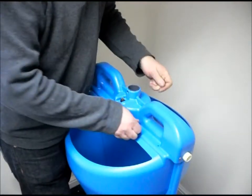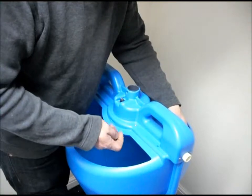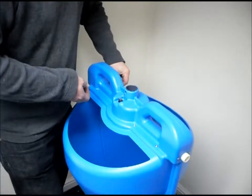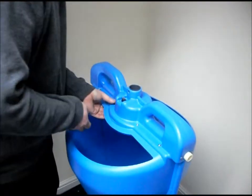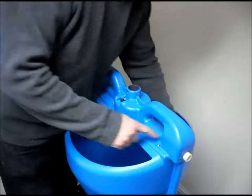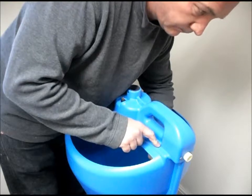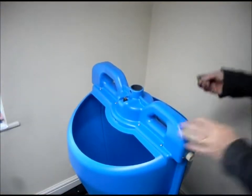Next step, obviously, just to put the screws back in position. All the holes should line up. If they don't, you can use a thin screwdriver or something just to lever it a little bit and get it into position. But as it's just come apart, it should go back together. So that's all 8 screws in position. Now just loosely fit the nylock nuts. And there's the nut I dropped earlier, caught in the trough.